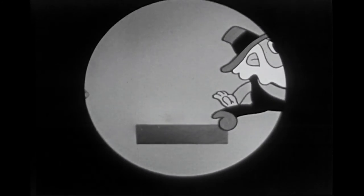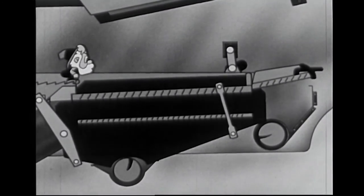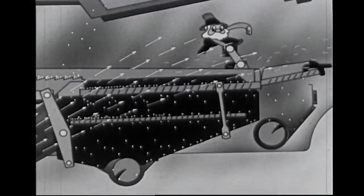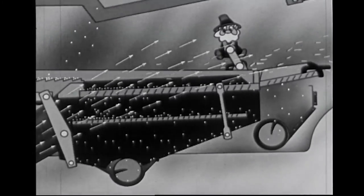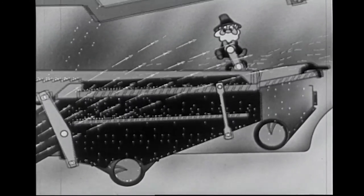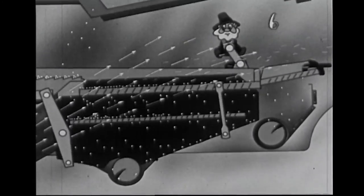Shift your weight along there and get a look at the double-action shoe. A double-action shoe — well, that's another good threshing machine principle. Here's a smooth-running, accurately balanced, double-action shoe that does a bang-up job of cleaning. When the adjustable chaffer sieve moves one way, the cleaning sieve moves the opposite way. Their weight and distance of travel are so calculated as to balance each other exactly — that eliminates vibration. At the same time, the opposed motion of the two sieves gives maximum agitation to the grain and chaff, assuring the kind of separation and cleaning every thresherman likes to see. That's swell. The IHC people have really been doing things to combine design, haven't they? Guess I'll have to give you a score of six on that shoe, mister.